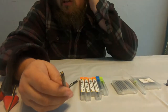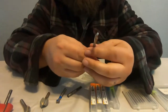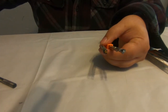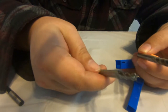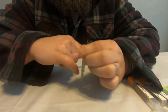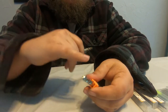Now this was a good bit, but as I noticed once I actually purchased better end mills — we've got this one right here — this is a two flute quarter inch end mill. So notice it has less flutes. What we originally did is we bought a kit of cheap end mills, all four flute spiraled. These work all right, but the problem I've found over time is they don't leave good surface finishes — not a flat surface finish very well, nor the sides when cutting out. When I went to this new carbide two flute, it is leaving an awesome finish. The swirls at the bottom are almost completely gone and the sides come out really clean.